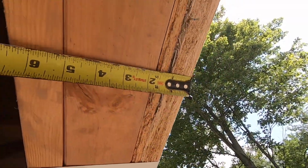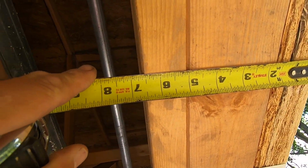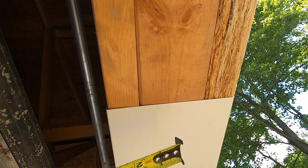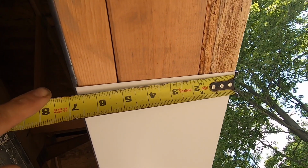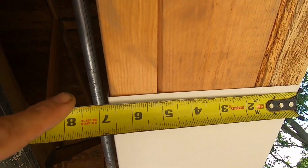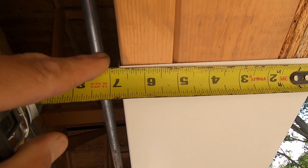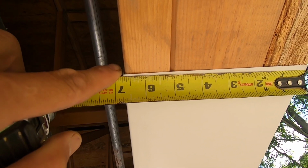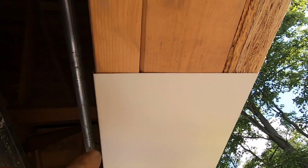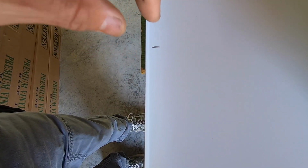Another tip, typically when you're measuring stuff to bend around, you just measure the wood here. Like here I got 6 and a big 5/8. But when you're overlapping a piece of aluminum that's already on here, you want to actually measure the aluminum. Right here I got 6 3/4. Here it was 6 5/8. So it's a little bit wider, the thickness of the aluminum, and I'm a slight bit big here. So you want that to go around that aluminum. If I did it 6 5/8, it would never go around this right here. But now I measured from the inside corner here to that piece of aluminum and then added 1 inch for just overlap here. So I've already measured 1 inch longer than what I had. I think it was 57, measured 58.